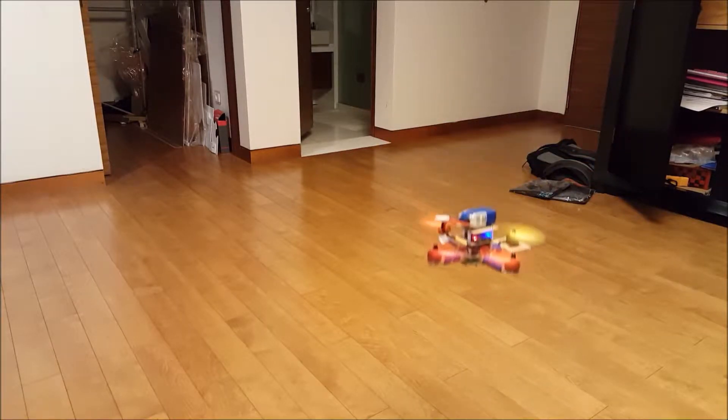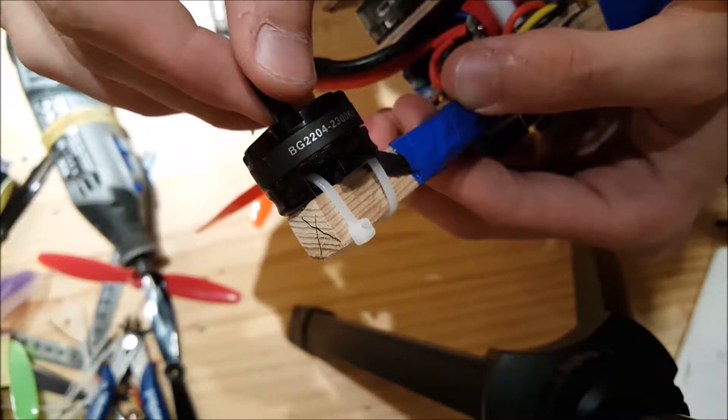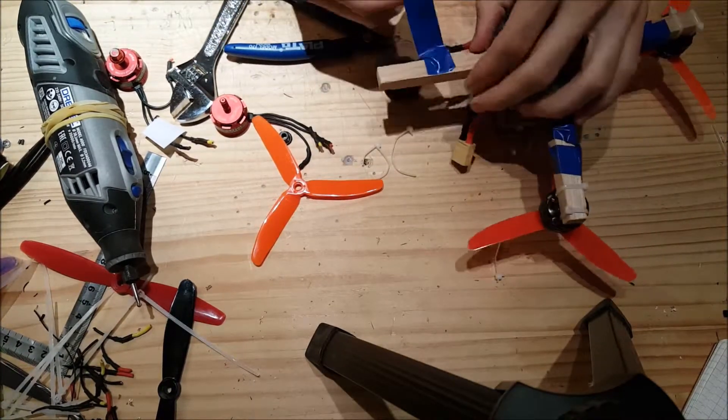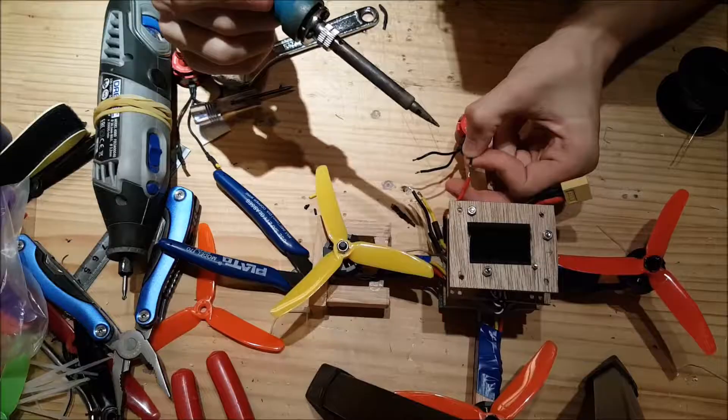But as you can see, there's a problem. After a bit of troubleshooting I found that one of the brushless motors reset itself automatically in flight. So I took it off, cut the wires, and used a similar motor. I mounted the new motor the same way, pre-soldered the wires, and soldered them.